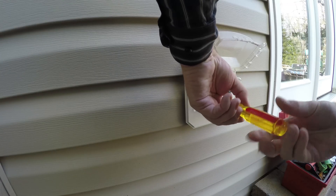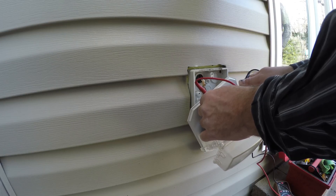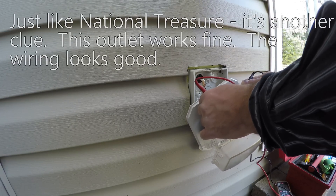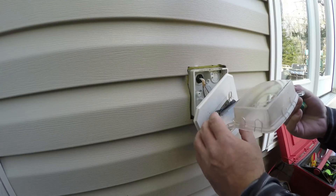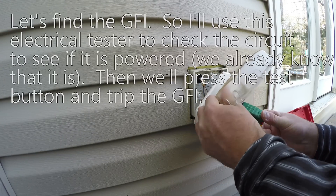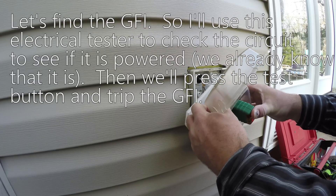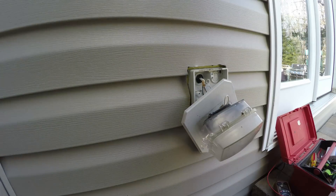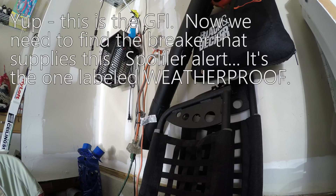So when did this stop working? Too much power. I guess I probably need to get somebody out here. We got power here, but this is the end — there's nothing feeding this except something else. So this outlet's working. We need to identify what GFI supplies this. We got power. Yep, we just tripped it. But that's the breaker or not.